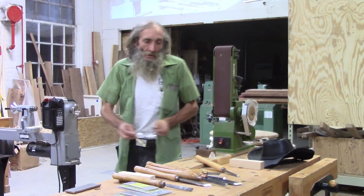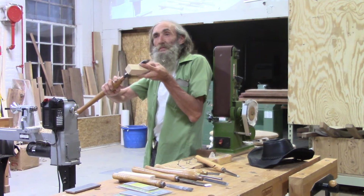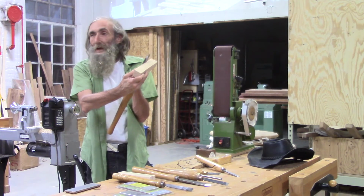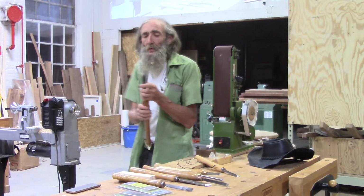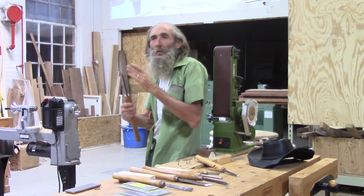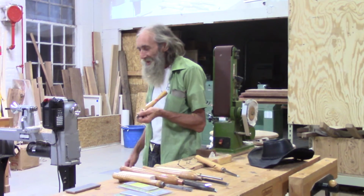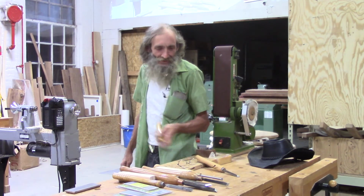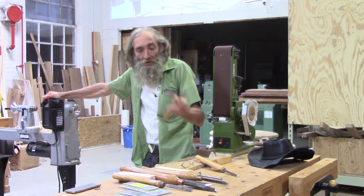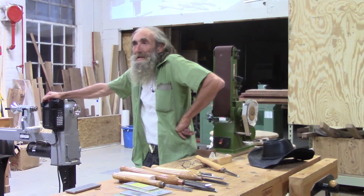I set my plate so I'm coming up to my wheel so that my bevel's right. I hold it so it's going to go straight across my grinder. I need three hands here, I don't have them. My other hand is at the back, keep it flat, and just go back and forth. All I'm doing when I take these to a grinder is creating a slight bevel into it. And if the shape for some reason gets out of whack, or as when I did the last demo, the guy was handing this one back to me and they dropped it, okay, that one needs a grinder. It was funny as hell, because I just said don't drop them. About once every 6 months, just to bring the angle back or something like that, I might put them on the grinder, but for the most part, I can do it right on here.